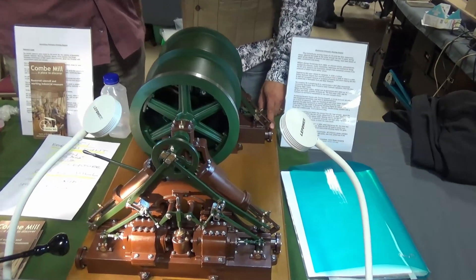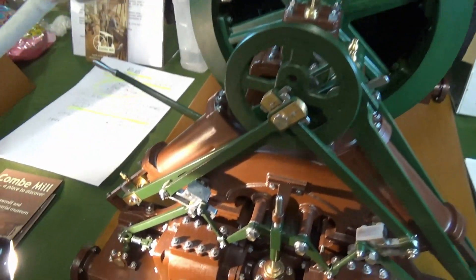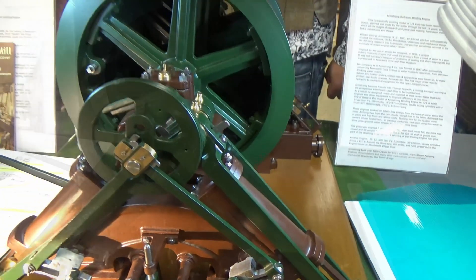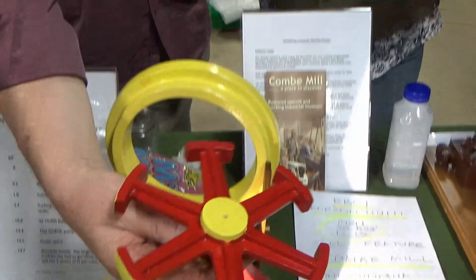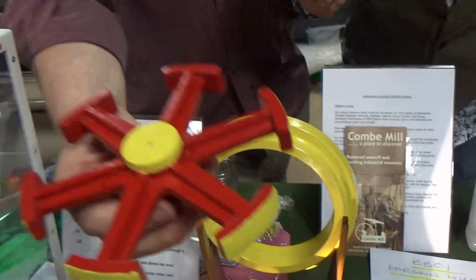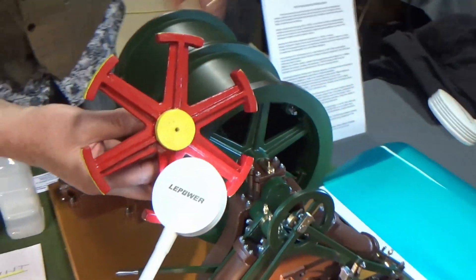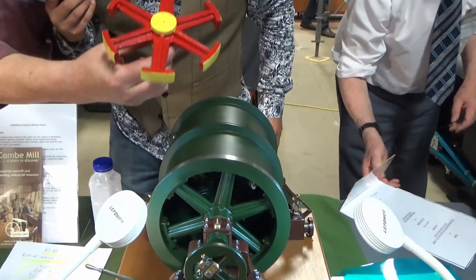A piece of art and a wonderful piece of engineering. To make that model, I had to make wooden patterns to allow pieces to be cast correctly — this is how they would have originally been made on the full-size one. This piece is called a spider, and it's made of wood. You can move it to where it is on the model and see the shape — and why it's called a spider. So you can see the difference between the wooden pattern and the actual cast part.